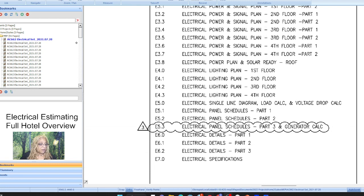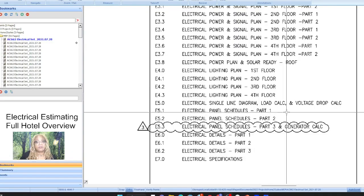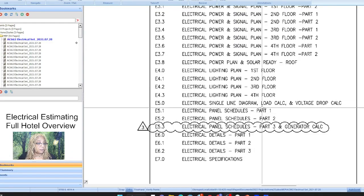And I would start building the estimate even before we're finished doing the takeoff, because you can do that depending on how you do it. The very last thing are all of the wire runs, and then doing the multiplication for the wire, right? Two number eights, one number 10 times 300 feet, or 5,000 feet of number 12 and 3/4 inch conduit.